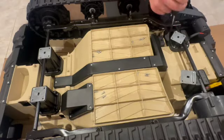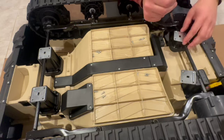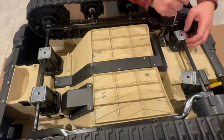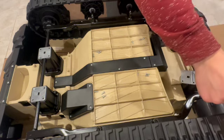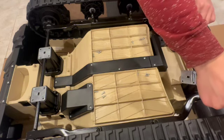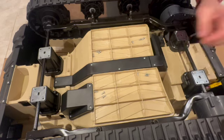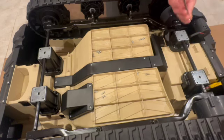So now when you want to line up the holes, let's just say they're not lined up properly, you've got to put this on, it's not lined up. Grab a screwdriver. If you pry on this side, it shifts the axle this way. And if you want to pry the axle back this way, you shift this way. You can see it move little by little, and then it lines up. Check the other side, it lines up too. Now we can put all four screws in.